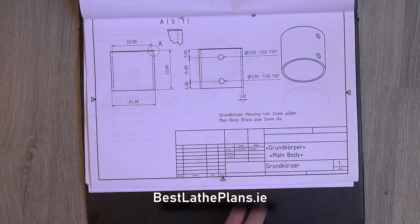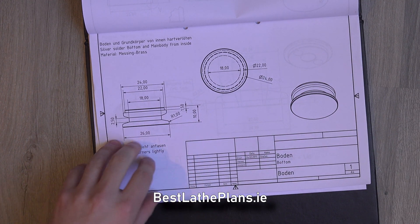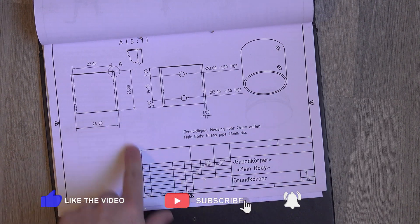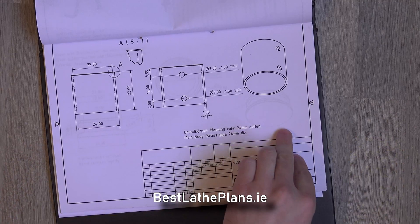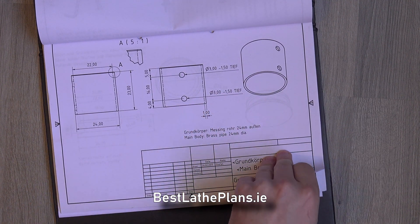As I mentioned in part one, I do not have any brass tubing as described in the plans, so I'm going to make the entire body from a single piece of 30mm round brass bar. This will need shaping and hollowing out and yes, I do know that is incredibly wasteful — I will be making a mountain of chips. I'll collect the brass chips and probably use them for casting something in a later video. The full body has an overall length of 31.5mm and a maximum diameter of 26mm. The main body section is 24mm with a decorative groove in the base. The hollow centre has a diameter of 22mm, which will leave a 1mm wall, at a depth of 21.5mm.